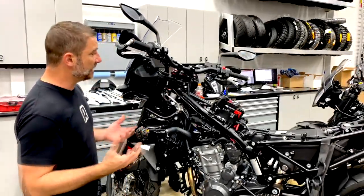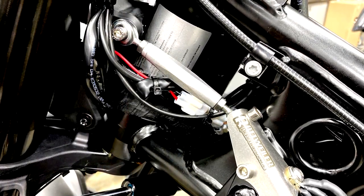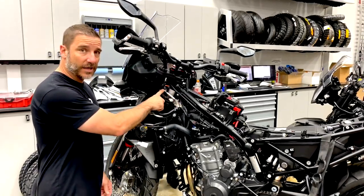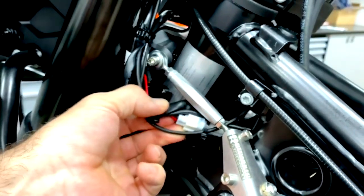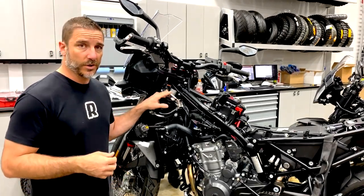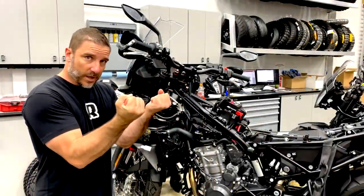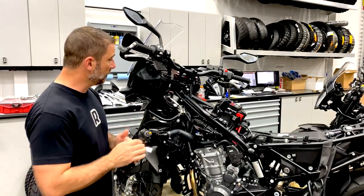The third aspect is it's very non-obtrusive. We don't need much because we're drawing a straight line here — there's no sharp edges, nothing to cut wires, everything clears rather nicely. It's a very clean setup. And because this is a turnbuckle, when you put it on you turn it by hand with your fingers a little bit, it draws good tension because it's adjustable, and then you tighten everything down — it makes for a really solid brace.